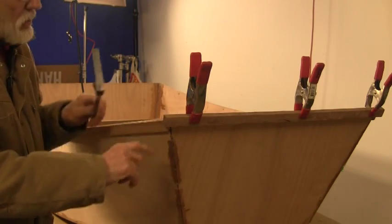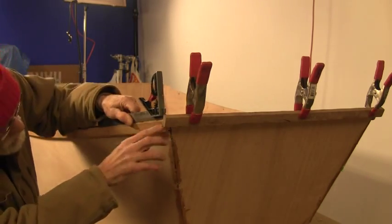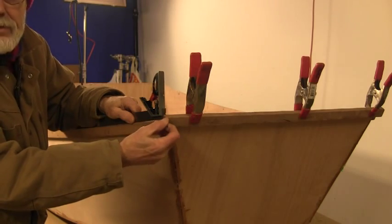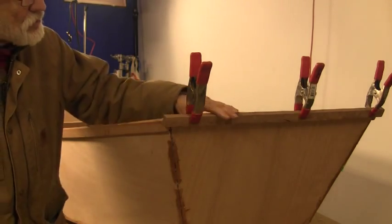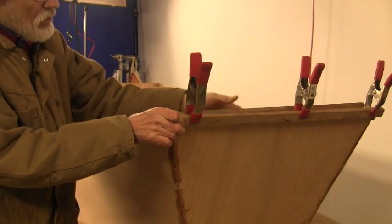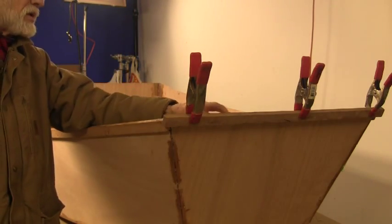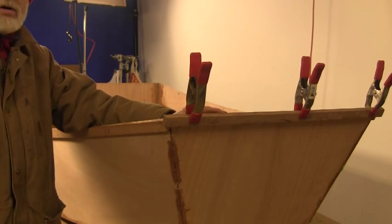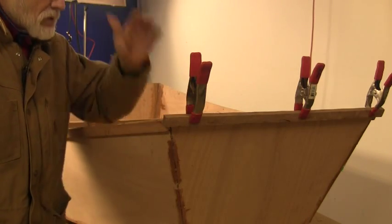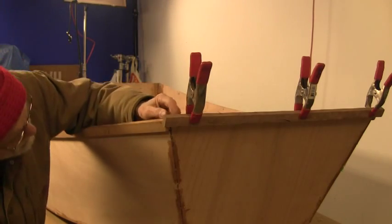It's sitting a little higher, and what I want is to set my anchor thing here on the rail and be sure that the projected edge comes up near the top of this. Because if I didn't do that and I put the other rail on the inside, that would tend to make the nose look like it's dropping off. So with this extra height up here, I'm probably sitting about a quarter, maybe five-sixteenths higher than the top of the plywood rail, which is high to begin with. But that gives me plenty of material to plane down, because I'm going to have to take down that much on the back of this to get in here.